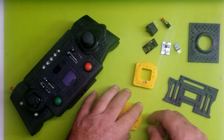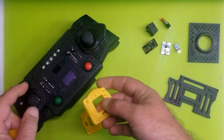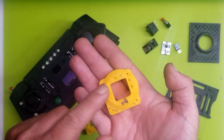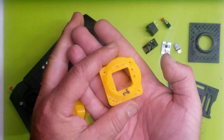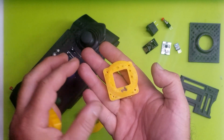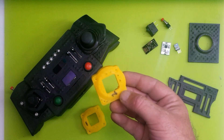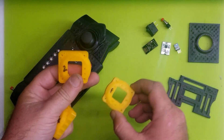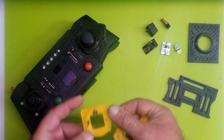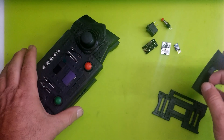In a previous video I talked about prototyping: if you're trying to refine something — get screw holes and alignment right — don't keep printing the whole piece. Cut out just the piece you're working on, work on that, and when you're happy, translate it back to your main piece. You can see here working on that joystick hole — I went through several iterations, but these are my final with just tiny tweaks to positions. One, two, three — nailed it.